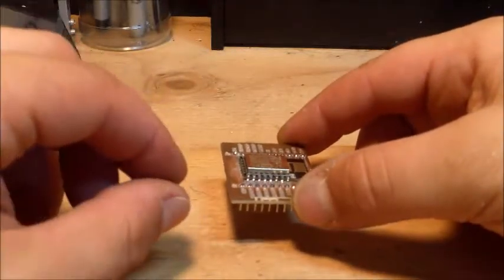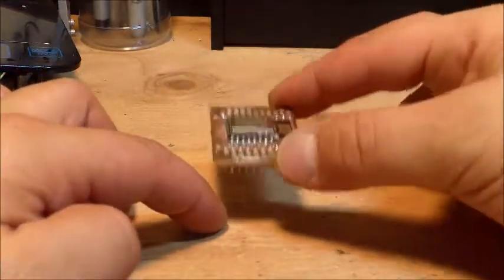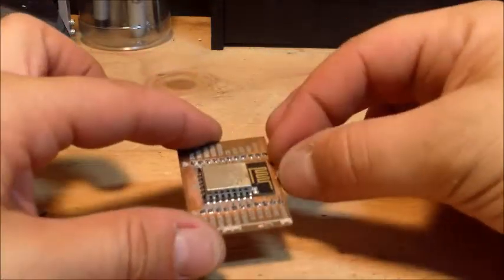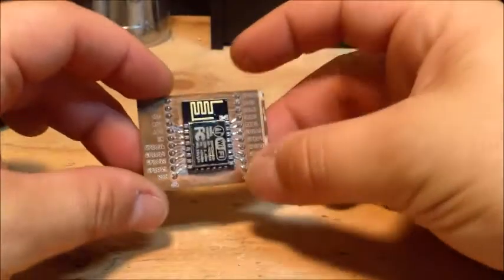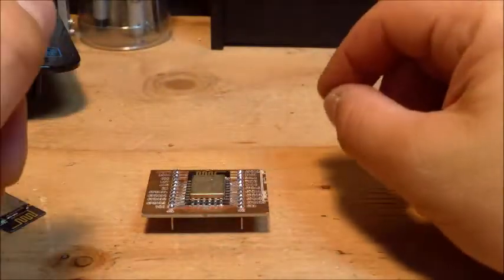The headers on the wires were too big. So I had to get some female headers and put them into the breadboard first to raise this up a little bit. And even then, you can't get underneath to wire it. It was too wide for the breadboard, so there's just a lot of challenges with this particular design, but it functions. I can get it into a breadboard no problem and do the basics.